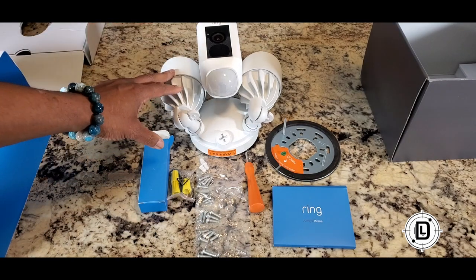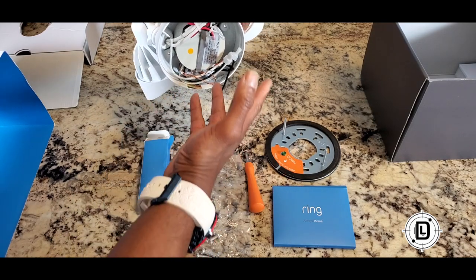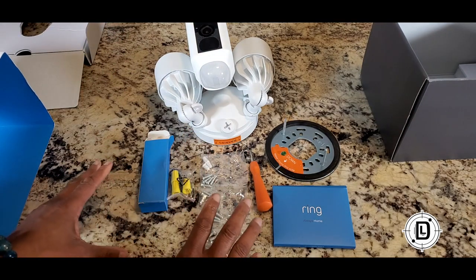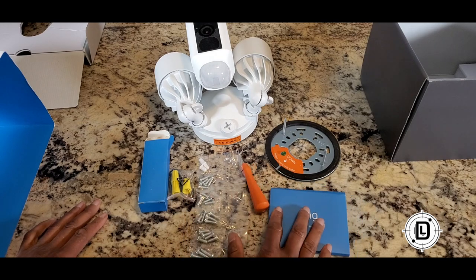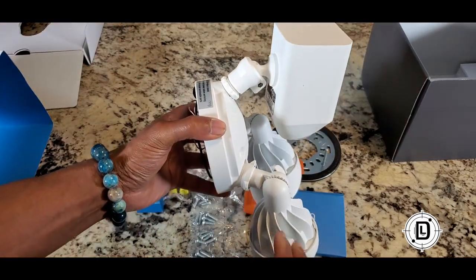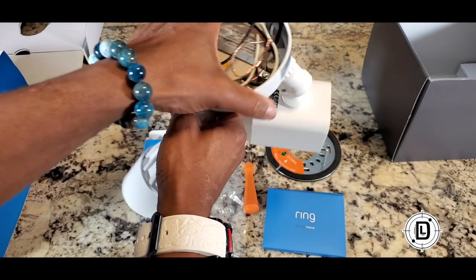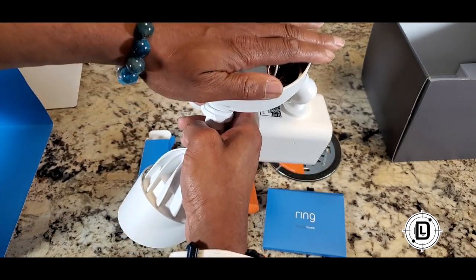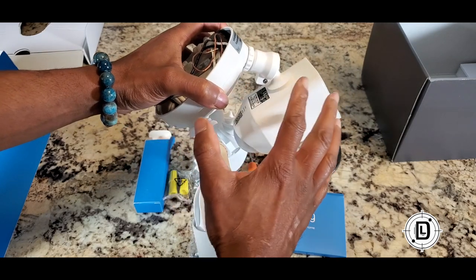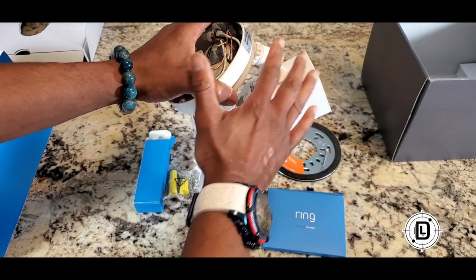You're basically taking off your old light and wiring it the same way you would wire your old light — just follow the instructions and you'll be up and running fairly quickly. Now this is for a vertical mount, which means this plate is going to go flush against the wall. If your floodlight is horizontal, underneath an eave or soffit, you can't set this up as-is.